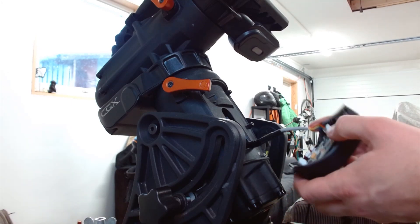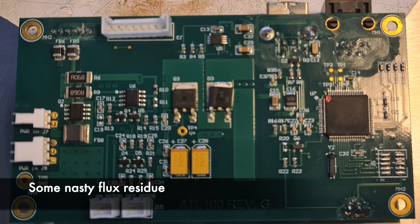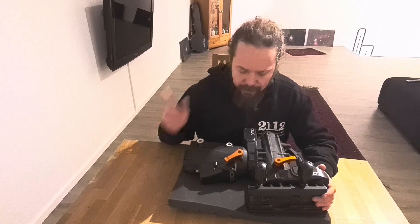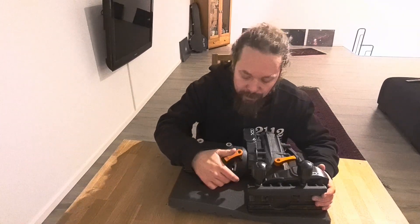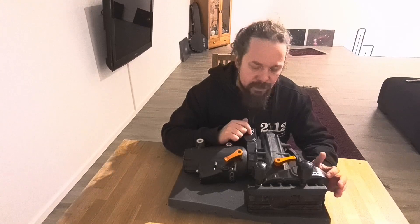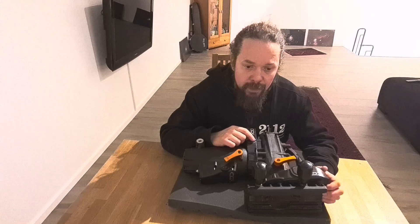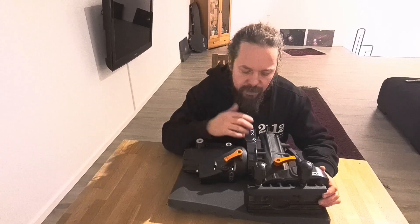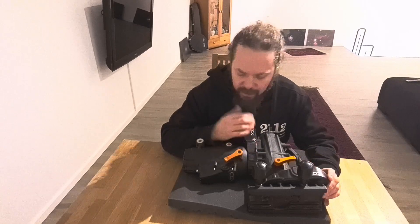I've got the circuit board plugged out. There's no sign of any burned pins or anything else as far as I can tell. What I did, which isn't in the video, was that I disconnected the gray ribbon cable with the wider connector on the MCU board here. As far as I could tell, that cable goes to the sensors — the switch position and end-stop sensors in both motors. I disconnected it and turned it on again, and then it did say 'go to switch positions' like it normally would. If you say yes, the motor starts slewing at full speed — right ascension went west at full speed, like it did when I first powered up. Since there was nothing telling it to stop, I just turned the power off. But that tells us the motors are working, so that shouldn't be a problem.